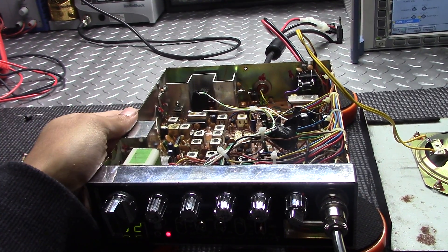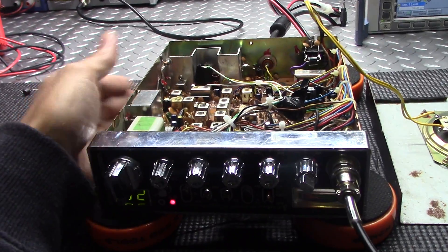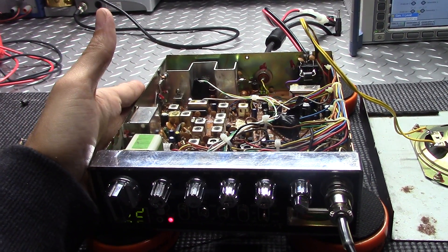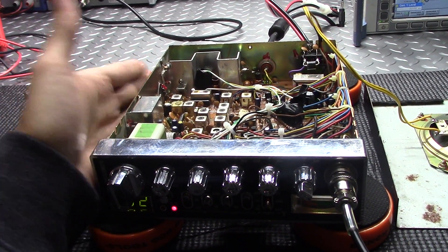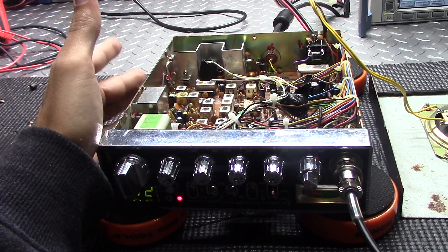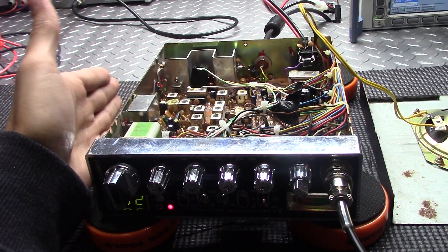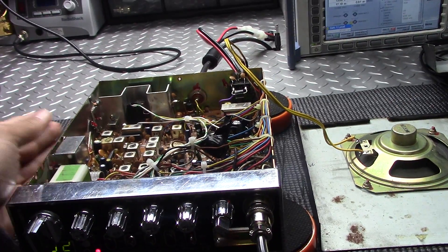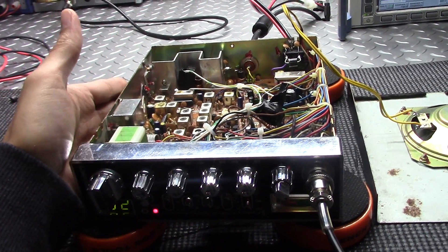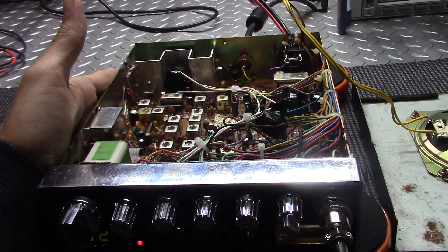So if you're already at 20 watts, you're not going to put another S-unit on a guy until 80 watts — and you're not going to get 80 watts out of one of these. I don't even suggest trying to get 50 out of one of these; if you want a 50-watt radio, go buy a 50-watt radio. The MOSFET is not an upgrade — it's a replacement final, it's a conversion, that's it. If it was really an upgrade you'd be seeing different power gains out of it.